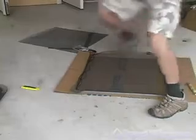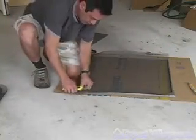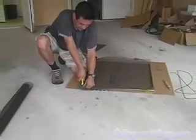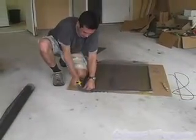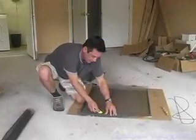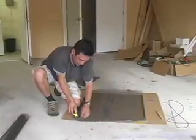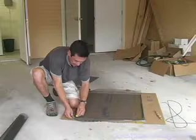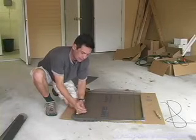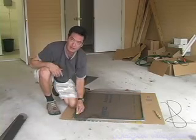When you're done putting the spline into place, you're simply going to trim it off at the end. Then with your utility blade, you're going to trim off the excess screen all the way around, being careful to make the blade come in contact only with the outer edge and not the spline or the inside edge of the screen itself. And once you've done that, it's done.